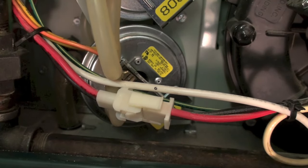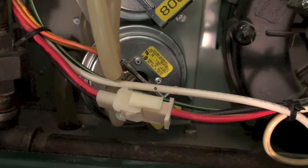Don't use general replacement pressure switches. When we first got into this industry, we did — like everybody else — and had all kinds of problems, changing them all the time. They never fixed it. Turns out we weren't venting the furnaces right. One common issue is if your vent pipe sags a little bit — it gets water in it, reduces the cross-sectional area of the pipe, and the unit shuts down. It can happen right away or after a couple of years. Use factory pressure switches only, and if you don't know what the pressure should be, you need to find out.